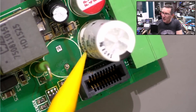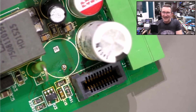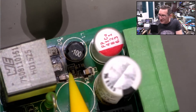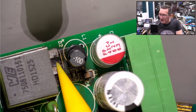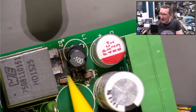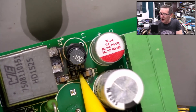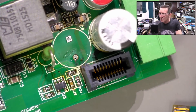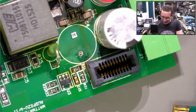Super cap fire. That track there is starting to go black. I don't like it. You could fix this — you could repair it. If that has gone conductive under there, you'd probably have to drill it out so it's not conductive. Everything's starting to corrode and it's not pretty. If you were desperate you could actually repair this, but yeah, nah.